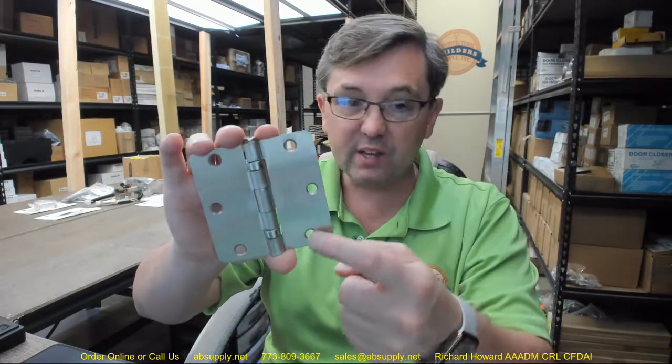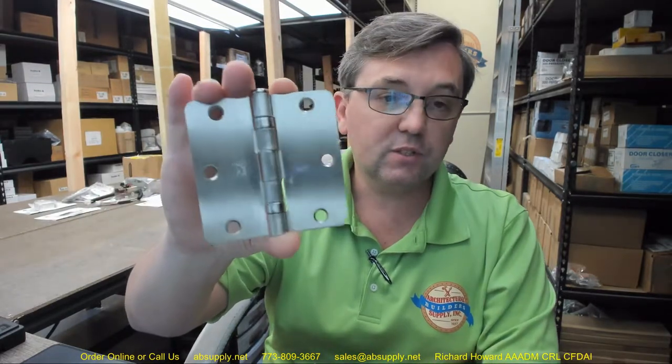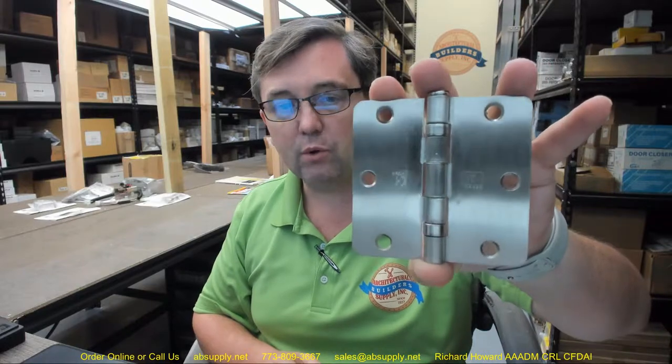From the center of the hole or bottom of the leaf — so if your pattern looks like this, a half moon some people call it, it is very likely this hinge is a perfect match. I would recommend you take time and measure those locations before you order. You want to be sure the holes are going to line up where you will put the screws if you are dealing with a new installation. The rest of the information on that template does indeed show lots of other hinges, but they are really only different in terms of how their corners are treated — and that is really how the part number changes.